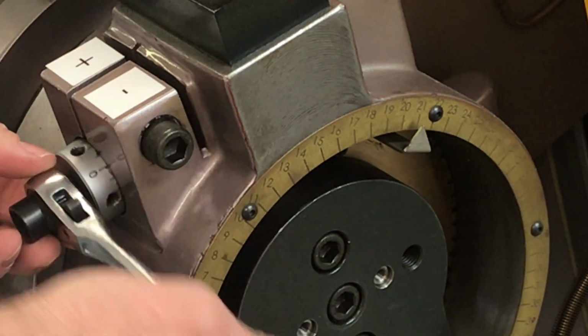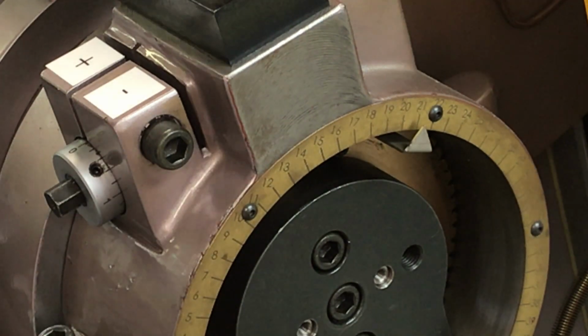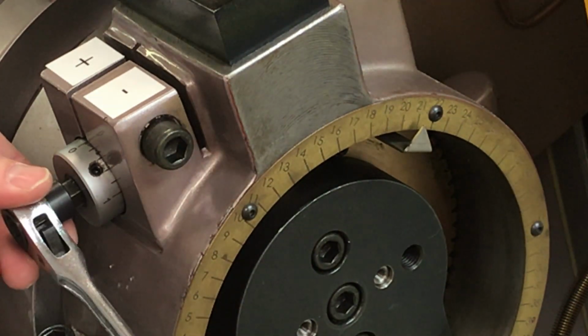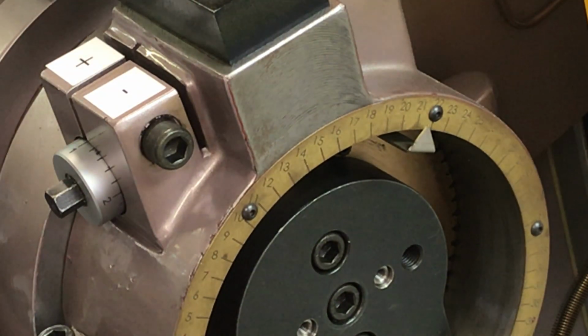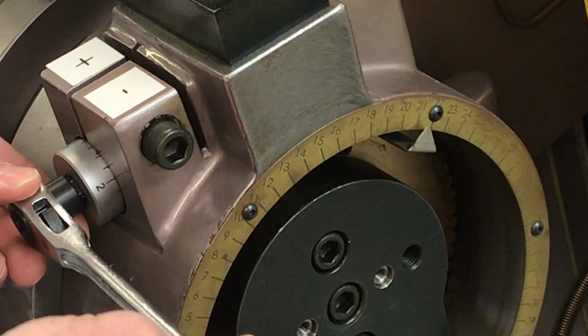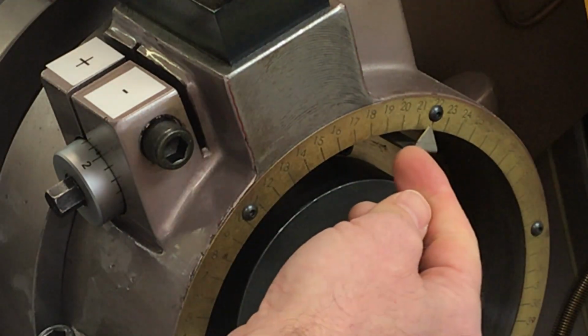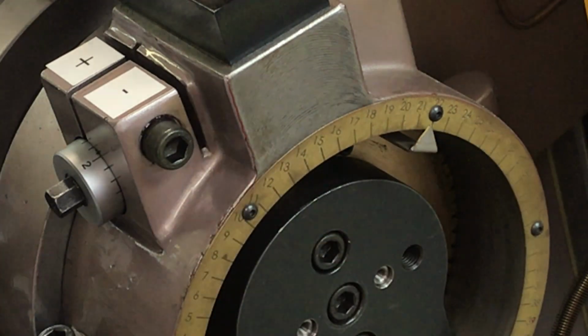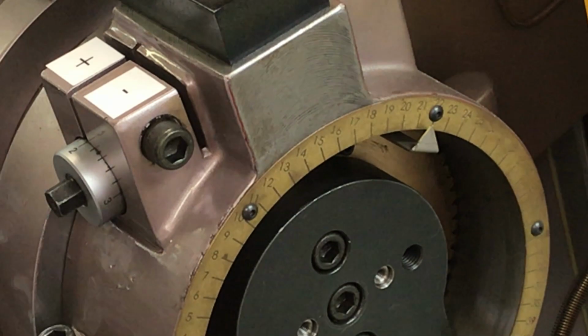So let's pretend that I'm at 21 and I run the press through its impression. I start to bring the impression up. Maybe I go to 1 to start and I see 90% of a cut. And then I want to go to 3 more lines. You can see on the side the micrometer gauge is moving towards 22. Then I go to 2, and now I've got a perfect cut.